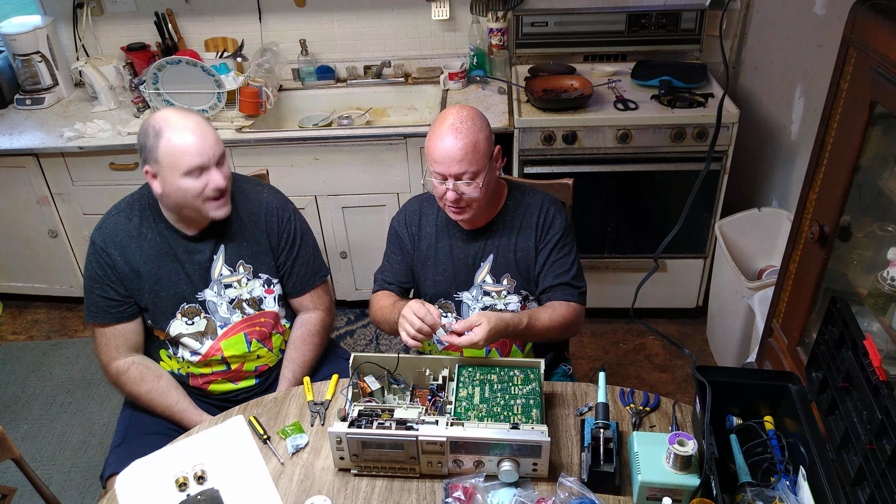That solder joint. Oh, it's kind of shallow over here. Mold it like this. Yeah, this side. You want it to look like that. Not the hole, but that. Just the solder joint. Yep. Beautiful. Doesn't that look beautiful? Let me check the other side. Yes, the other side looks good too.